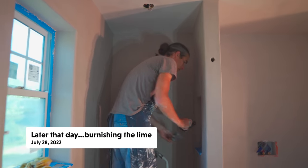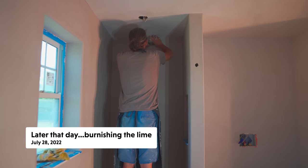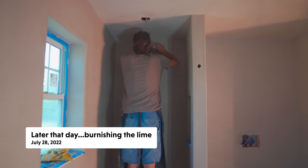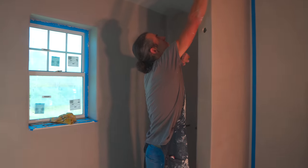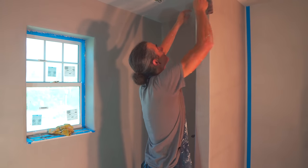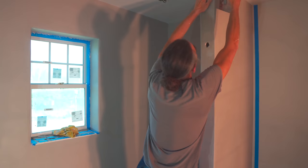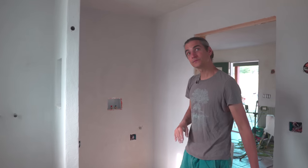And you're not pressing with anything other than a plaster, like a steel trowel. The angle is very important. Just not pressing too hard and not pressing too early, because if it's too wet, you don't want to burnish it yet. But you can't burnish it if it's too dry. So it's all like a little art project. Yeah, art and timing, I guess.